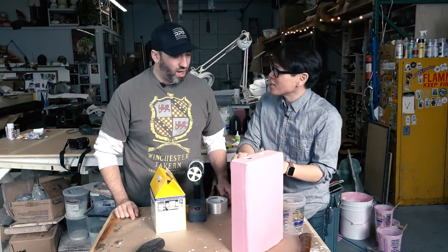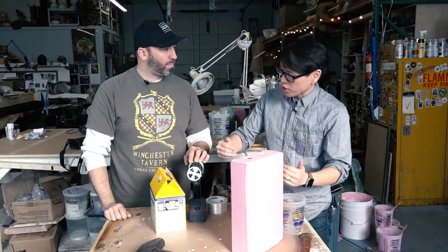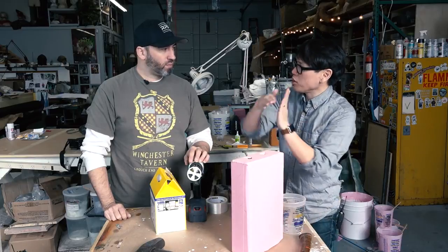Demolded. How's the process? It's a little tricky — I've done it a lot because I used to work in the toy industry. If you look up on YouTube how to do a jeweler's cut, which is kind of what this is — a modified jeweler's cut — it'll show you the intricacies of how you make the registration. Is it more important to have good registration around the size of the mold or to have a smooth parting line on the object? It's both — it's a tricky technique to perfect. Anybody can cut a mold in half, but making it line up really nicely and repeatedly — that's a bit of an art.